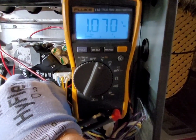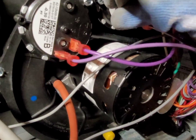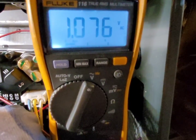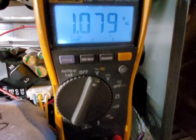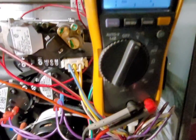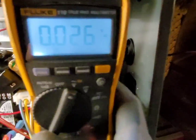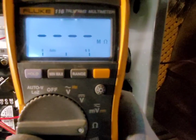I always like to verify 24 volts to ground on either side of the pressure switch terminals to confirm the switch is physically closing. In this situation we did have power on either side. Since this is kind of an intermittent issue, I'm checking for voltage loss through the switch — and in this case we do have about 1 volt of voltage loss.